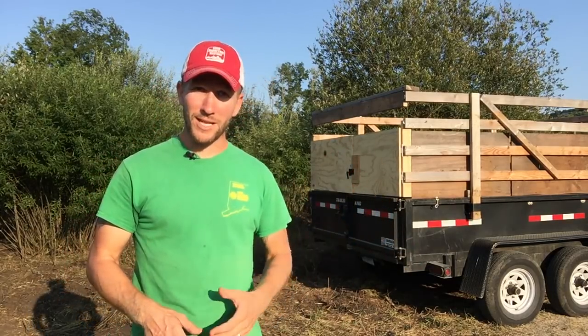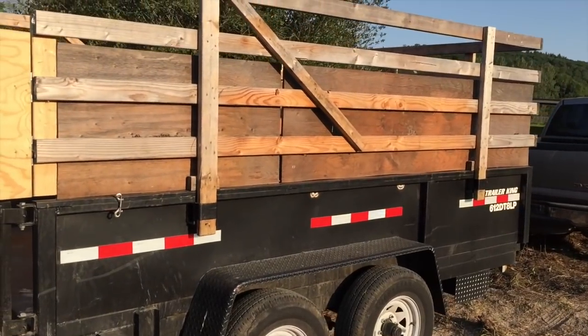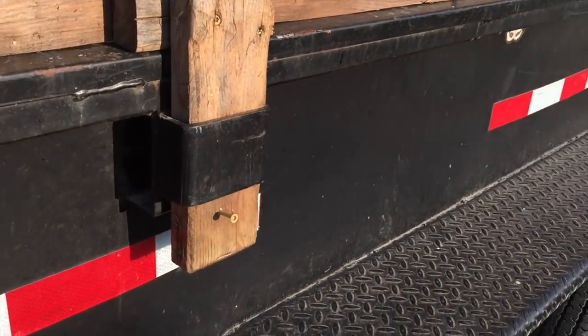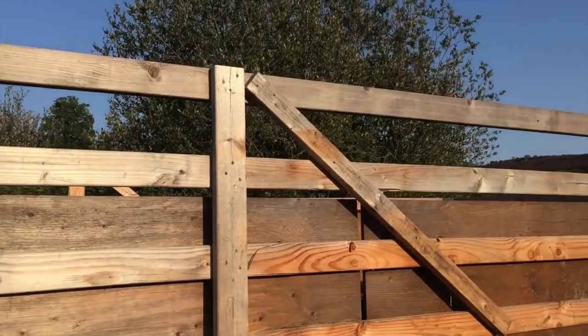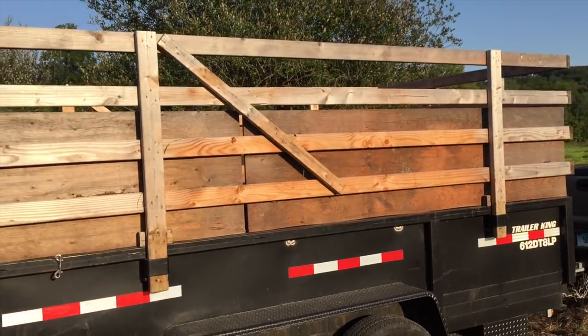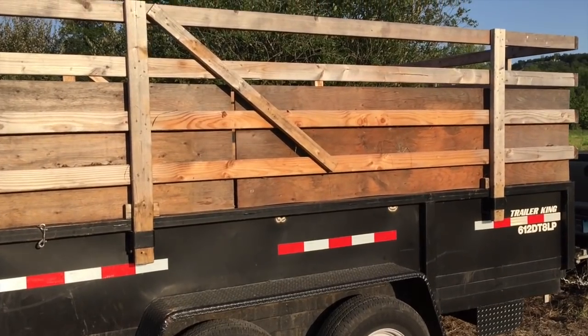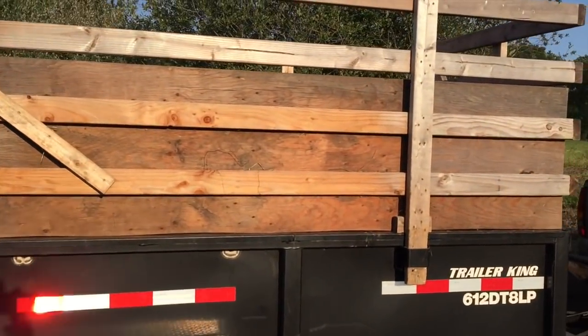So with this, I'm going to now take you around what I did to make a livestock trailer. Walking around the pig trailer, this trailer had some slots for 2x4s, both this way and that way. I utilized that to make mobile sides. So this one side comes out all as one unit and then slides back in when I need it to. Gravity keeps it there, plus a little bit of a keeper screw so it doesn't walk away from me.